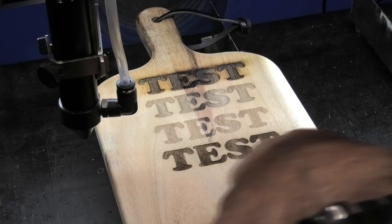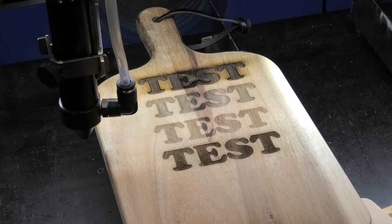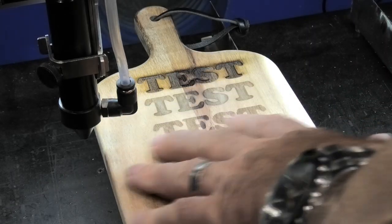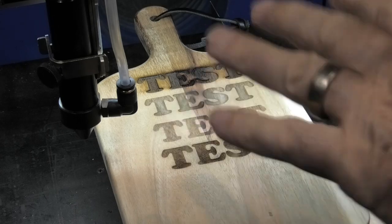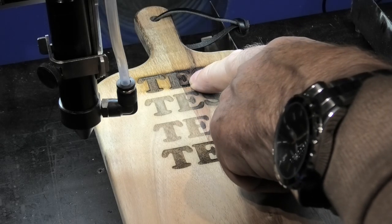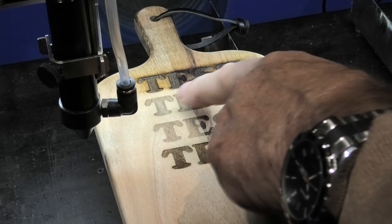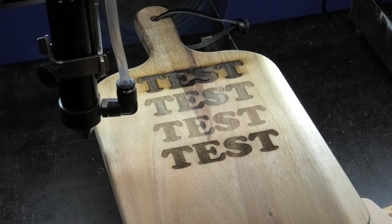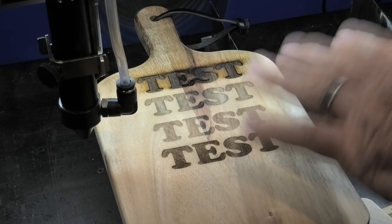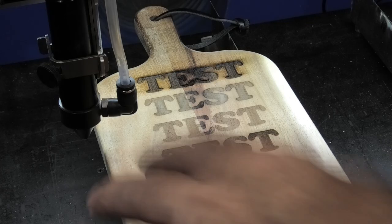Each of these materials has a different strength and will shake to death at a different amount of vibration. So different molecular structures in this thing called wood are accepting this light energy at different rates. Some accept it readily and burn deeper. Some resist it and burn less deeply. And that's why you appear to get different colours. Now, I've started to overcome that problem here with what I've done to the text. We'll talk about that later, but again, we need to go through this process step by step. So you now understand that you've got a product which is not uniformly going to accept your laser beam.